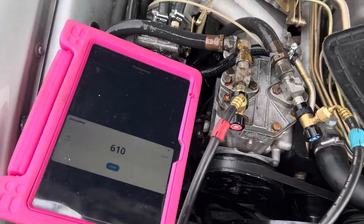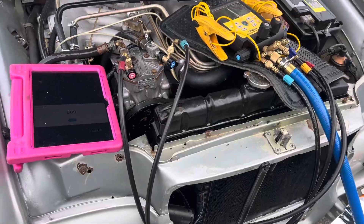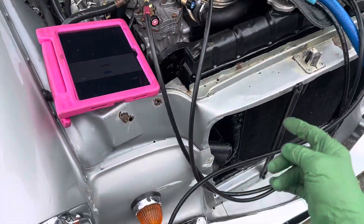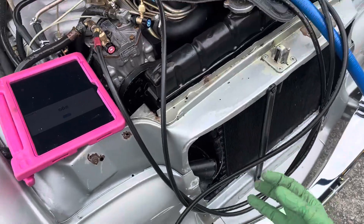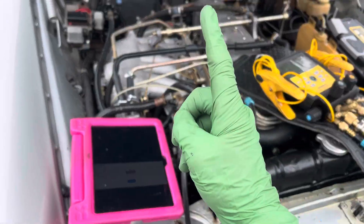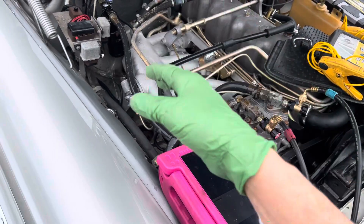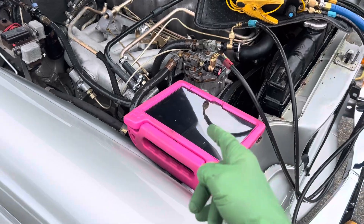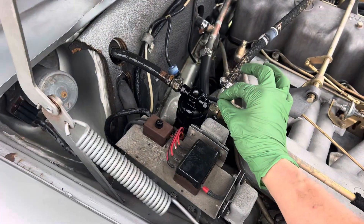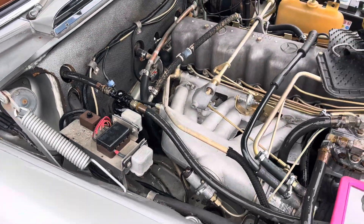I'm going to do a little experiment to show you something. At 200-250 psi every hose was leaking like a sieve — stuff was just bubbling out, huge leaks everywhere. But only at 200 psi or above. At the vapor pressure of refrigerant, when only refrigerant was in the system, there were no leaks anywhere — just a little bit of pickup right here, that was it.